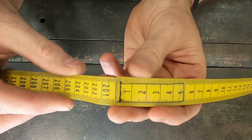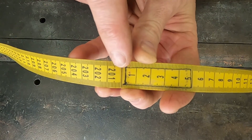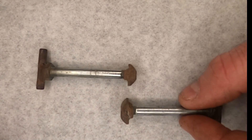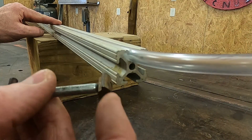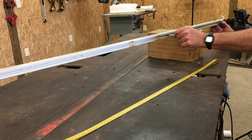A graduated scale can be something as simple as a ruler, yardstick, or tape measure — it just needs to be attached to the grade rod in such a way that it's easy to reference the level of the water inside the tube. I used an old tailor's tape measure that I cut and then sewed back together in a loop so that the starting end, or the zero, lines up at the 200-centimeter mark. The nuts on the end of these bolts are specially designed to fit inside the slots on the T-slot rail, and I can lock them into position by simply tightening the bolt. This allows me to attach my tape measure to the side of the rod and adjust its position higher or lower as needed.